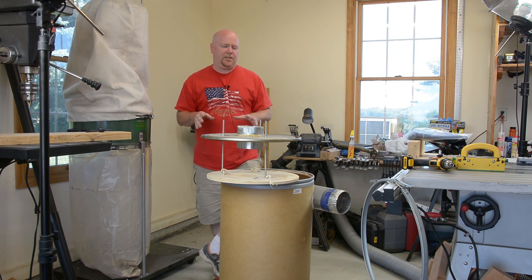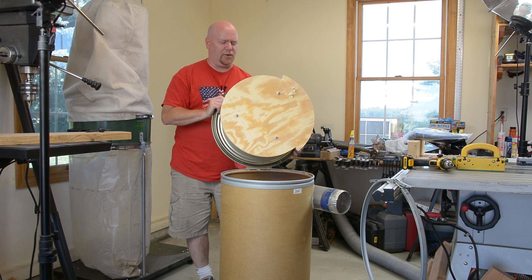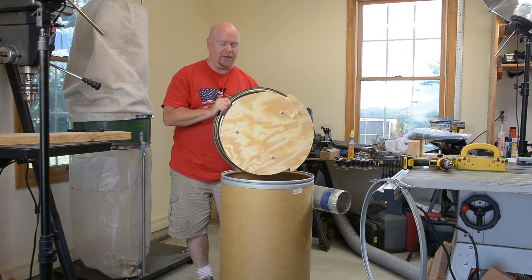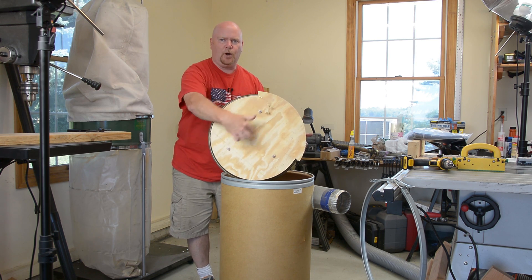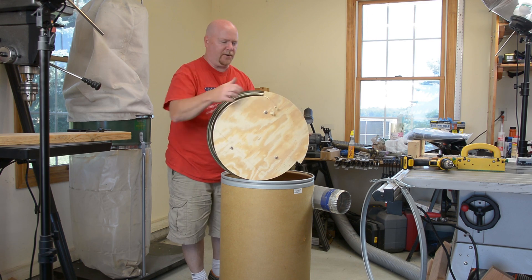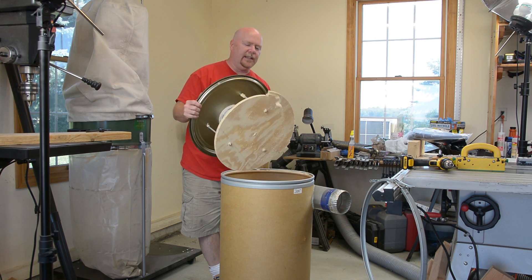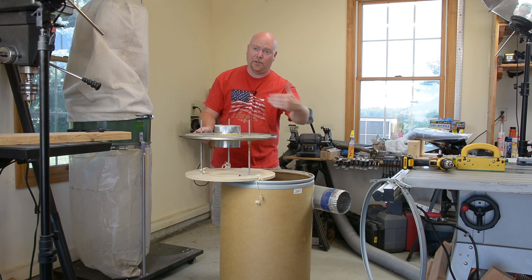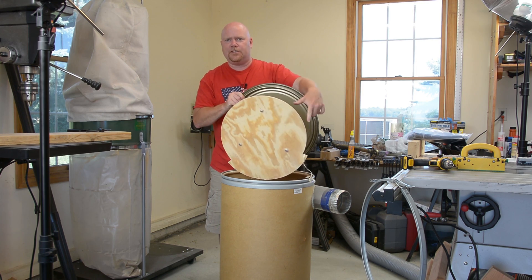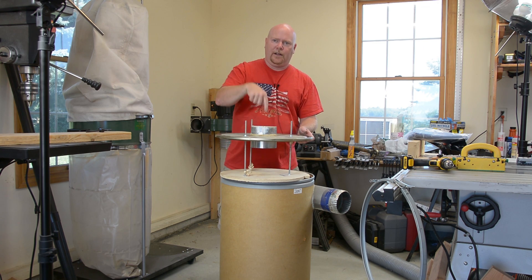Inside we find the first piece of magic of this modification. This is what's known as a Thein baffle — I'm not exactly sure how you pronounce it, but it is a well-documented contraption out there on the internet. Essentially you've got this mostly circular plate with a lip out here. What that does is it forms any barrel into a cyclone. That lip lines up with the inlet where the air comes in, causing it to go around the barrel. The solids spin out and drop through the gap created by the cut-out piece. Meanwhile, the air circulates around the top and eventually comes out this hole.